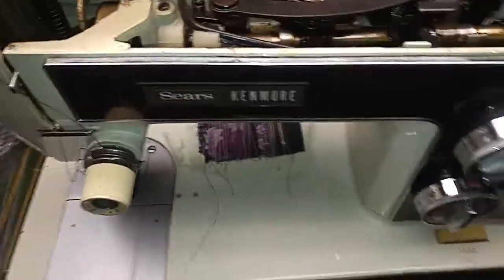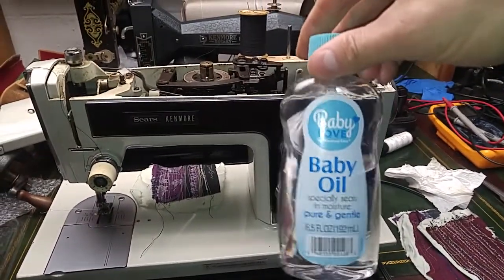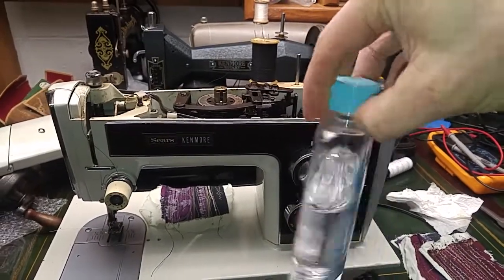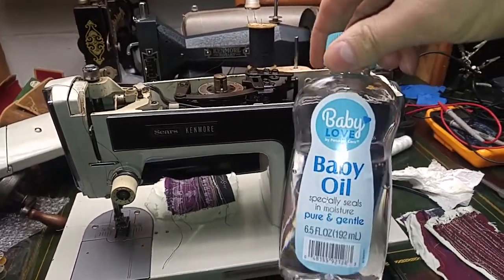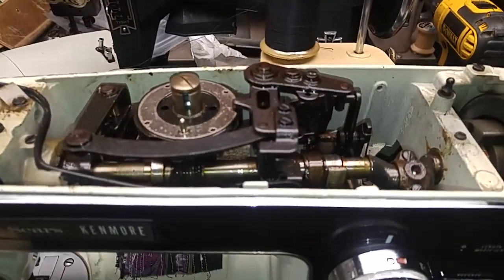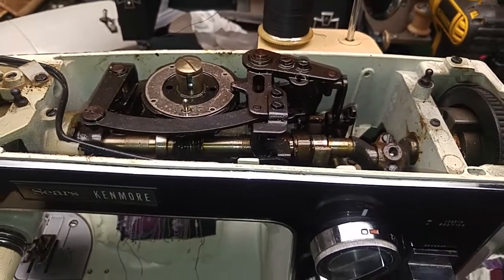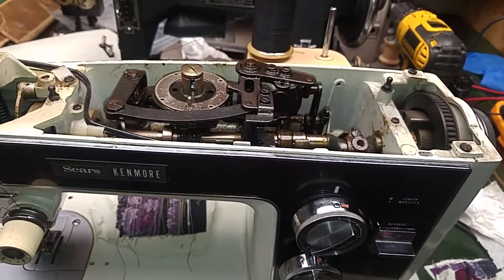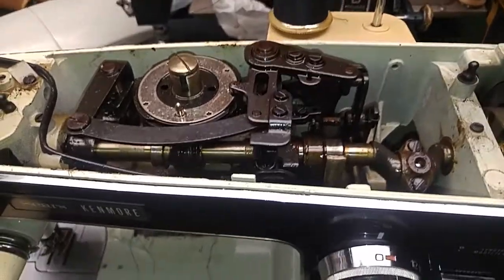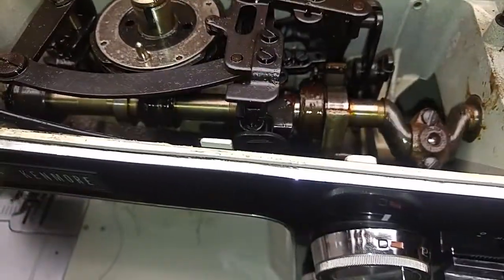I'm sticking with Baby Love right now. This is mainly for cleaning and it's a really lightweight oil — you can see how lightweight that is. That's lighter than the medical grade stuff you see at the pharmacy — it's like water, a little thicker. It's 99.5% lightweight mineral oil. I don't know the exact CST yet but it seems very low, in that 20 CST range. My machine oil is 9 to 23 CST, so it's got to be right in there. Zoom might be a little lighter — the lily white oil. I've only been using the Baby Love and it's working great as an oil.